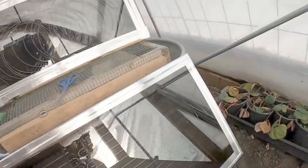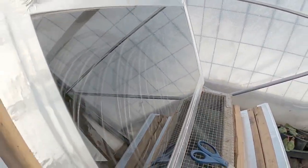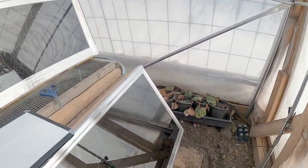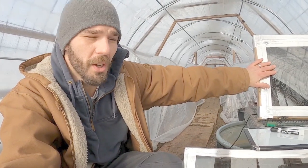I'm going to shut this water off here so our water will have a chance to rebuild some steam. I need to grab my little whiteboard and marker — hopefully my marker is not too darn cold. As we've learned in the last few episodes, we've been talking about heating water and heating air. Heating water requires a lot more energy, and heating air doesn't require nearly as much because it doesn't have that thermal mass or BTU holding potential like water does. Heating one pound of air — or 13.3 cubic feet of air, which equals one pound — by one degree Fahrenheit only requires 0.24 of a BTU.